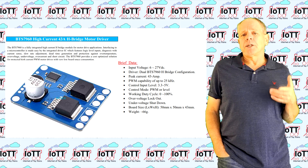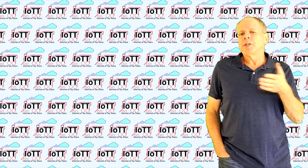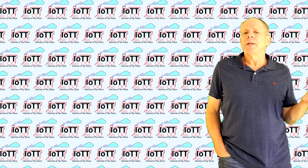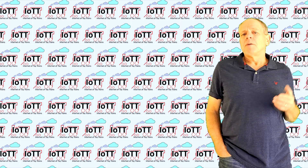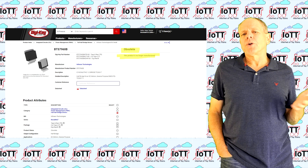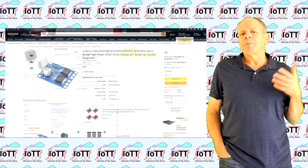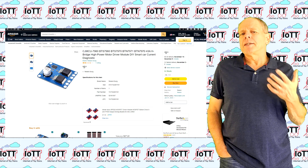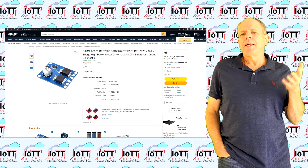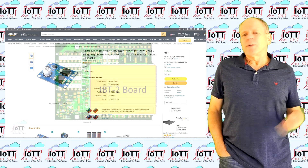As with other boards, I had the option of doing everything myself or using a ready-made commercial device and just designing a carrier board and interface circuitry. Since there are only a few components required, I would normally opt for making the entire board myself, but I ran into a problem. Finding the BTS 7960 chips is not easy as they are no longer manufactured and prices are going through the roof. Ready-made boards on the other hand can be purchased on Amazon or AliExpress for a quite reasonable price of about $5 a piece. So I decided to use the ready-made IBT2 device I tested in video number 105 and place it on the carrier board.